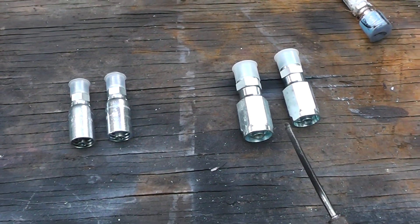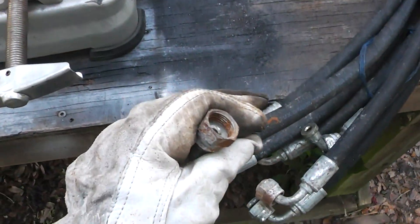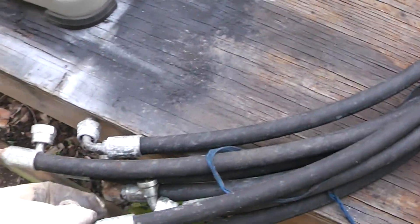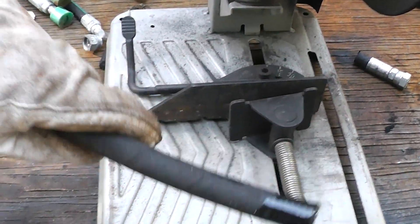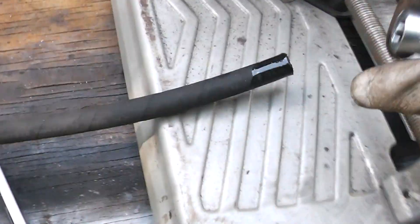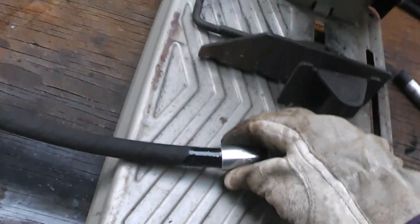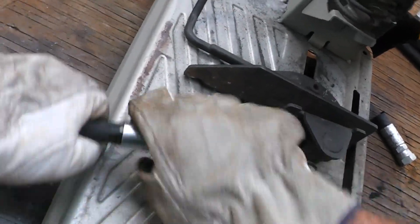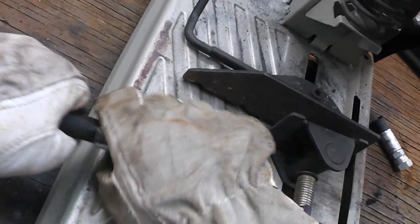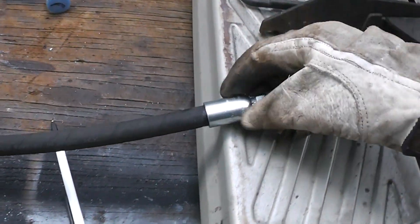Not only do I have a tractor, I have several pieces of hydraulic equipment, and I'm hoping to add a bucket truck one day which will also require hydraulic hoses. These are some hoses somebody was throwing out — the ends don't work for me since I have NPT National Pipe Thread, but I figured this would make a good test hose. I cut it off square, lubricated it with some oil, and made a mark at the proper insertion depth. It went right up to the mark, so all I need to do now is crimp it.